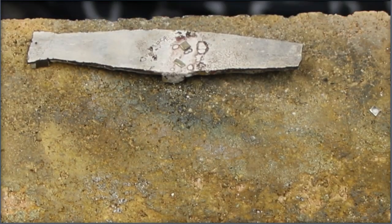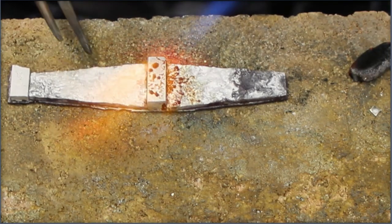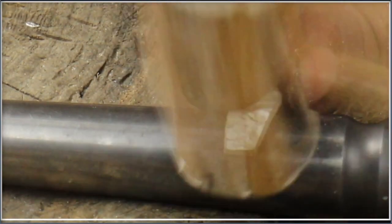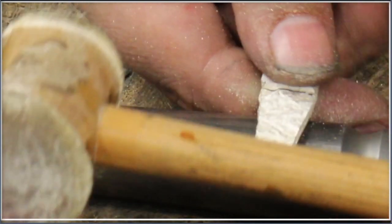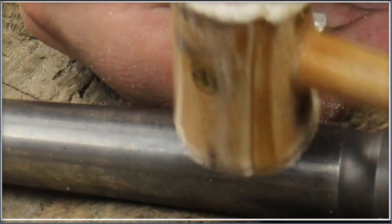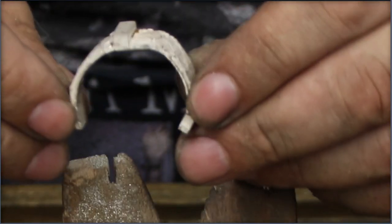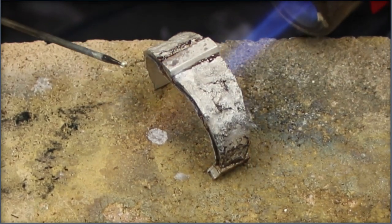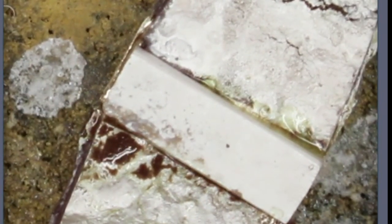This resulted in a nice seam that I managed to solder badly. It became clear that this material was very stiff — hammering almost had no effect and after only a few blows my solder joint cracked. I opted for the quick solution: just heat it up and hope everything turned out fine. Guess what? It didn't. The seam wasn't closed and there was solder everywhere.